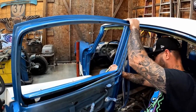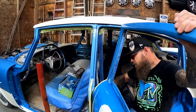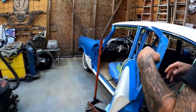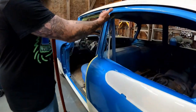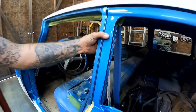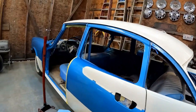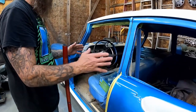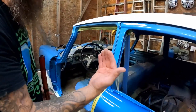You guys may not even see it on camera because it's so minor. Another thing you can do is if you got everything looking good all the way around except for right here, you can come in and just bend the window frame out just a tiny bit — they move like butter. I think we're pretty dang good. I'm going to leave it where it's at for now, hang the next panel, get it lined up with this one, and see if we need to move this out or just bend the window frame out a tad.